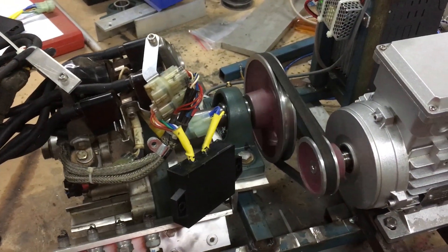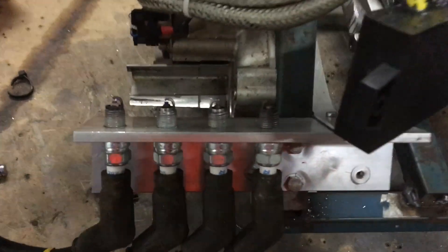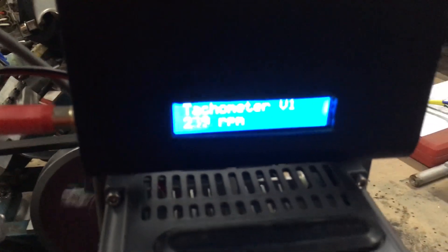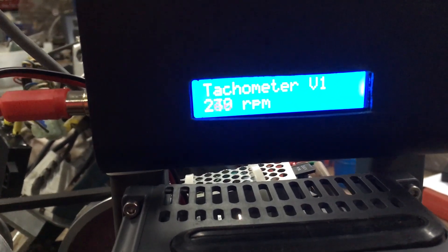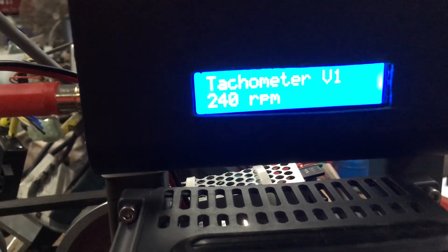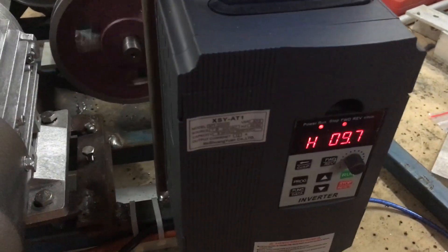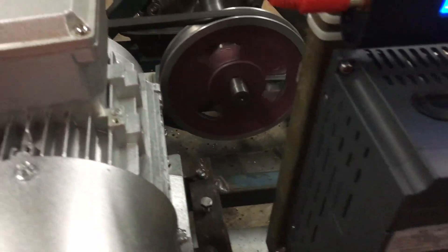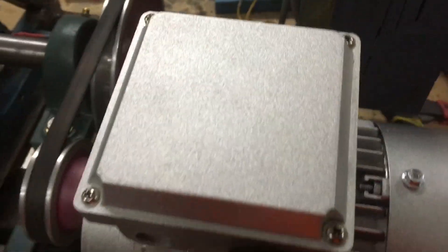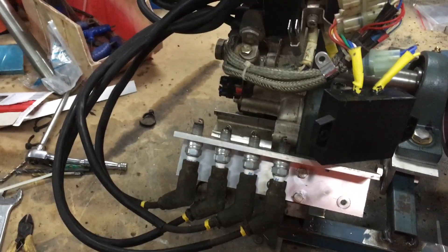The unit is running, almost finished the four plugs. This is the starting RPM — you can read that. The engine would be starting at 240 RPM, with the VFD controlling everything via a three-phase motor. I can only get up to about 1680 RPM.